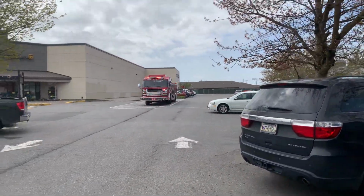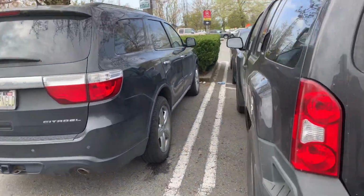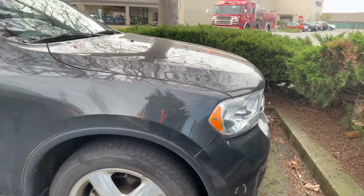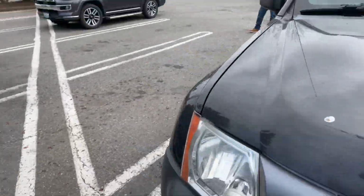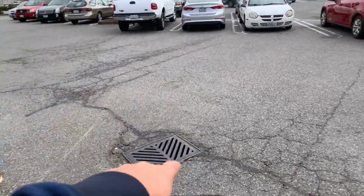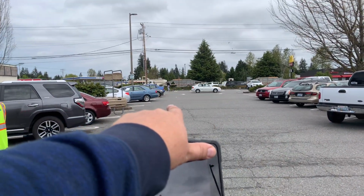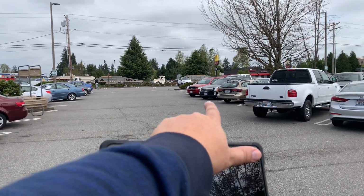This from the store right north of this tree line here, you've got tree root damage in here. You can see that right there, tree root poking up. So this stall will get removed, an 18 by 9. This entire drive aisle here, we'd fix around this catch basin, but we would get this entire drive aisle, get all this alligator cracking removed out of here, and we would stop right at the cart corral here and go across.